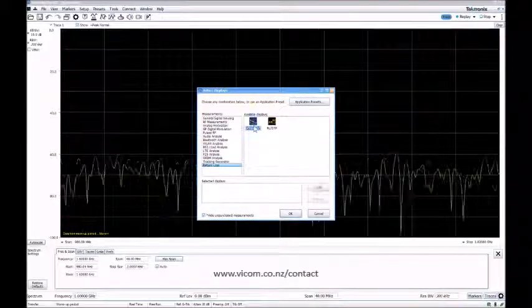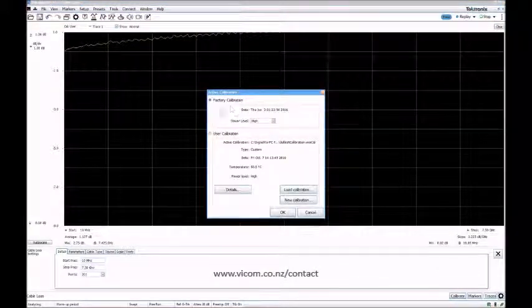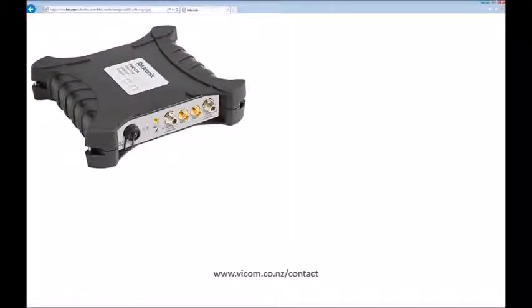So I will start with the cable loss measurement. I will just bring it in here and press OK. And then we go to calibrate, and I will use what we call a factory calibration. Factory calibration is actually the output of the unit. For those of you who are not familiar, all the options down here, we will only use one input. So on gain and loss measurement, you have to route from the output to the input. In this case, all the measurements we do, just this output, and we connect a cable or cable plus antenna to do some measurement, or a chain. So for most people that are doing a transmission, you want to make sure that it's not too much power reflected, or that you have a good impedance match.